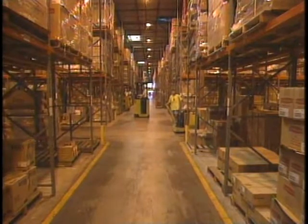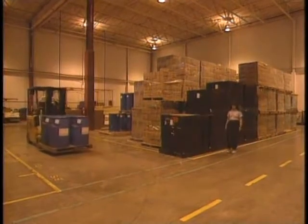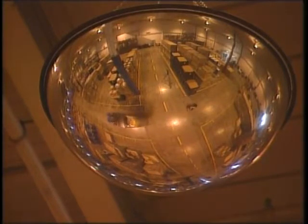Defensive operation of the truck is the key to your safety and the safety of others. As you approach a corner, slow down, sound the horn, and proceed with caution. Scan in all directions and use any safety mirrors that are available. Since they are usually placed in locations where your view is blocked, it is essential that they be used. However, don't forget that anything you see in the mirror seems much smaller and farther away than it really is. And remember, the horn is there for a reason — use it wisely to communicate with others. However, the horn is no substitute for slowing down or stopping and proceeding with caution.